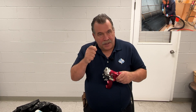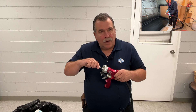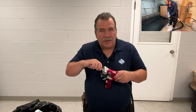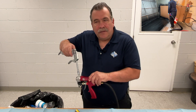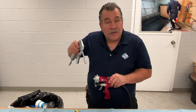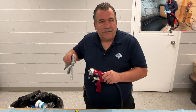Make sure that you have the correct size drill bit — that is key. You have to make sure you have the right size for the corresponding mixing chamber that you're using. Make sure that you're cleaning the entire inside of the front nozzle and the mixing chamber, then give it a quick shot of grease as we did before. You just need two pulls of the grease gun. Your air is still going to be on, and you want to make sure the grease comes out the front of the PCT.